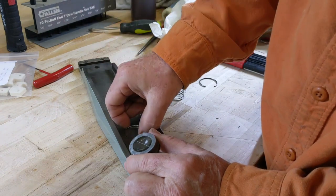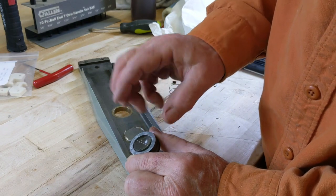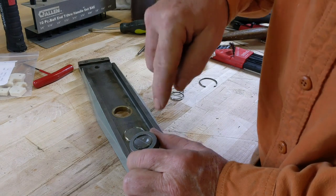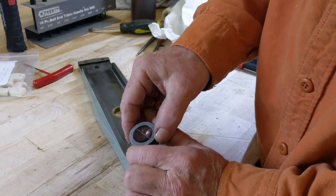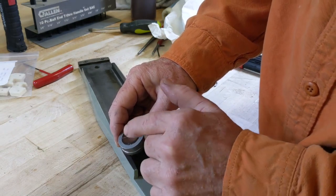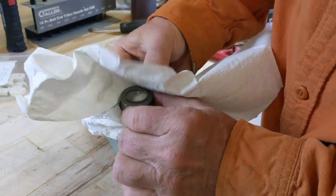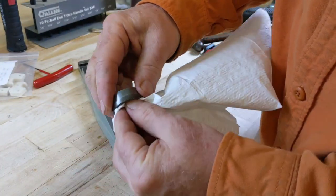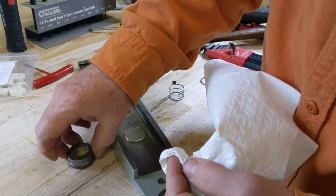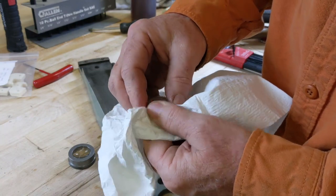When you're cleaning these parts up, be very careful with solvent-based cleaner. I was wiping the outside of this with some acetone because I really believed it was glass. I saw it started to react with the plastic and went into a little bit of a panic — I thought I'd ruined it. But what I did was pour some acetone on top, let it run off and sit for a minute, and when it evaporated it restored the finish to the plexiglass or polycarbonate. Thankfully it was recovered, but I'd say that was a stroke of luck.